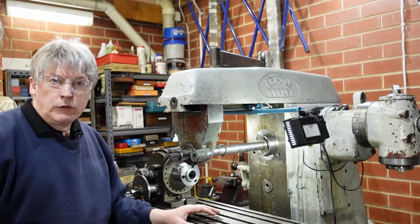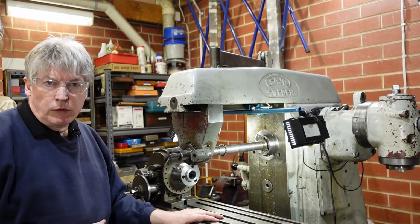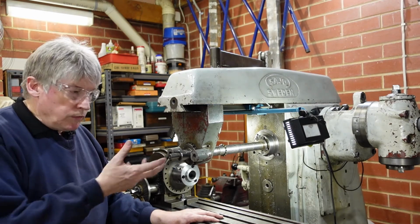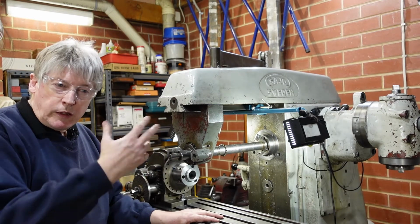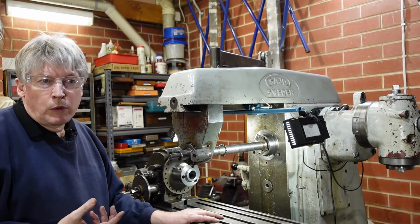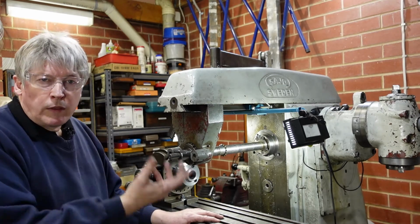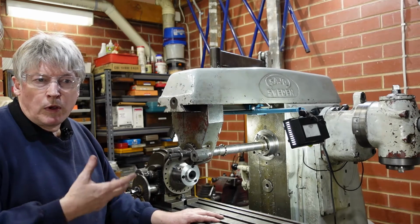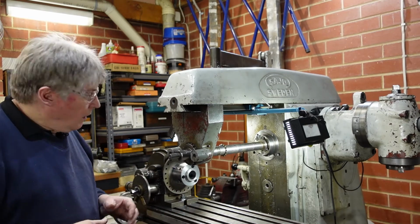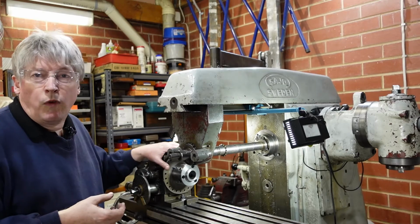So here I've converted the mill over to horizontal. It's my preferred mode for cutting gears, but it's taken me about 15 minutes to do this. You can imagine, and I'll check this when I turn it back, that once you've converted this way, you will take a similar time to get back to the way it was. Now, this is one reason why I try to do things in batches, so that I'll wait until I get 3 or 4 gears come through, because if I did this for one gear and then changed back and then for another gear, it would take an enormous amount of time. So even by doing, say, 3 gears at once, I'm potentially saving myself an hour and a half worth of setup and breakdown time. I've got the dividing head bolted to the table, but I'm still to set that up, so that's going to take another, well, we'll find out.